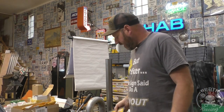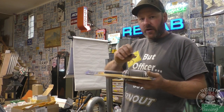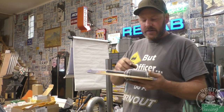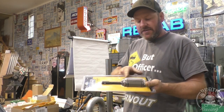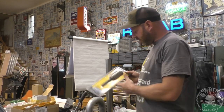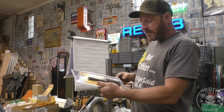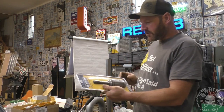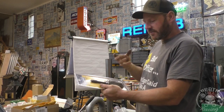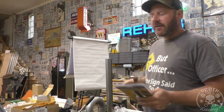So I modified one. One of the problems with it is you have to put this die all the way in the tube for it to work, otherwise it just makes a bell because it'll expand on one side and not the other. So you have to put it all the way in and then you're expanding so much tubing that it makes it even harder. My first thought was just to cut it off, then reflare it and put the groove back in for the rubber band to hold them so that it's easier to put in and out. The rubber band doesn't need to be there while you're using it, it's just there while you're not. And it worked - it worked a lot better, but it still wasn't as easy as I was hoping.